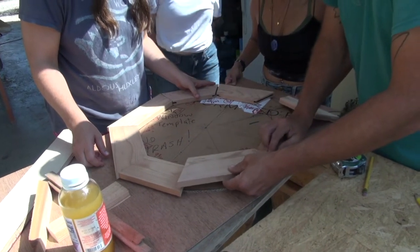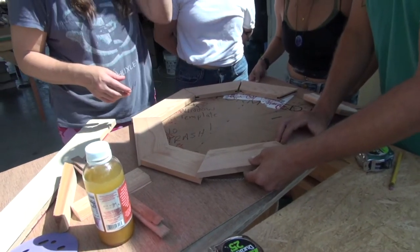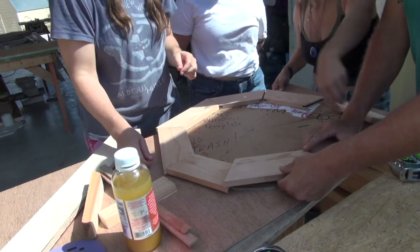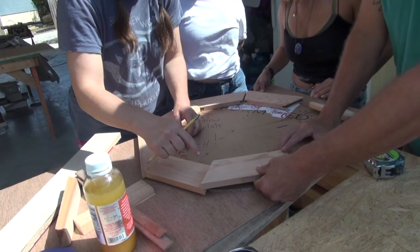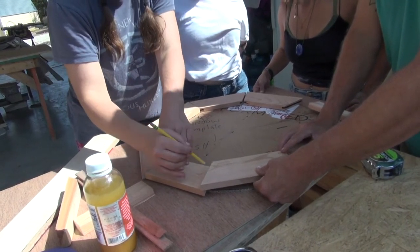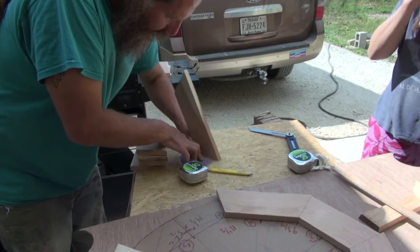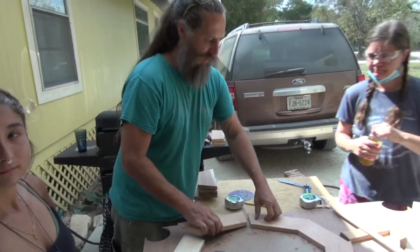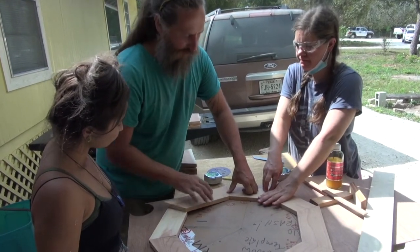So if we come off of here and trace that line right there — just put your finger there so it does not move, and then go ahead and trace. So we're going to cut F, not G. Just nibble up to the line to make a tighter joint as we're making our way around the elliptical octagon. Because we're still cutting into this elliptical shape to have a roundish window frame, this line doesn't have to line up exactly — this joint doesn't line up with that joint anyway.